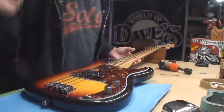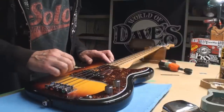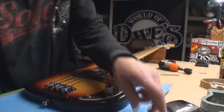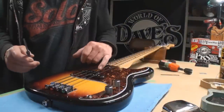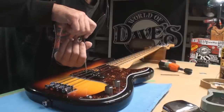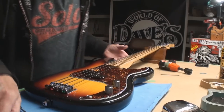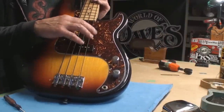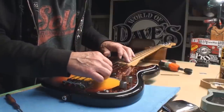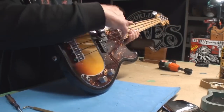Let's check the pickup height, which seems to be too close. Somebody asked me about angling pickups on a P-bass. My understanding is that on older pickups where the pole pieces are different heights, that's because back then magnets weren't as good. Now the magnetic material is such that I can't perceive any string not vibrating a magnet in there properly. It still needs to go down a little bit — I'll check it in the middle. The biggest problem is they always want to lean over on the foam.